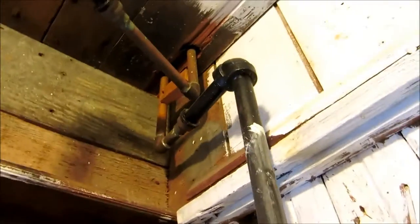These two here are coming out, going to be capped. See them two going up, them two half inch. I've got to put two monoflow T's here to pick up that second floor. And I'll run over here, turn here. And here's my pipe again, going down all the way down. I got it hung again.